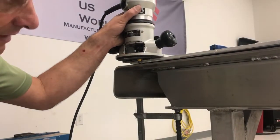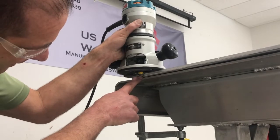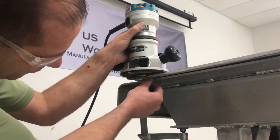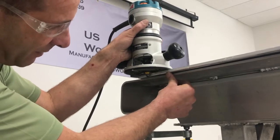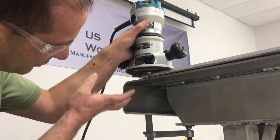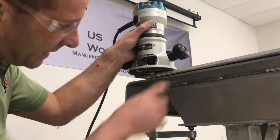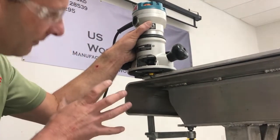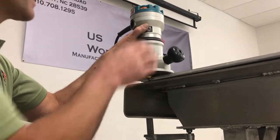Okay, we're set up, we've clamped our piece, and we're ready to do side two. Really important here: this tiny little bearing needs to hit the surface and it doesn't want to be slipping around that radius. If it is, we have to change our height or use a bit with a different radius, otherwise it's going to gouge into the top. This is looking good — I'm going to cut and you can watch what happens.